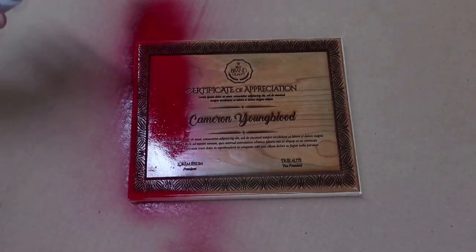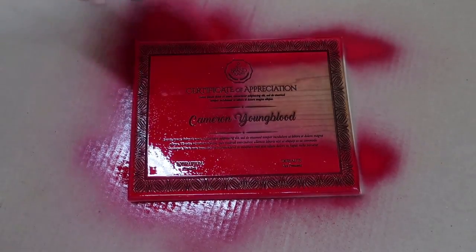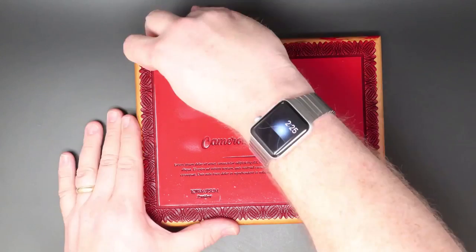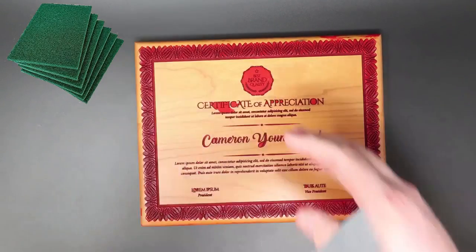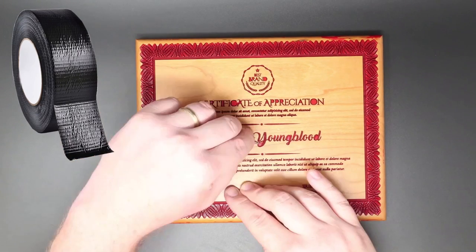Once the product is finished engraving, remove it from your laser machine and paint inside the engraving using whatever color or colors you and your customers have chosen. Once the paint is dried completely, simply peel off your masking. In our experience, gentle use of a scouring pad or duct tape will quickly and easily remove masking even in areas of high detail.